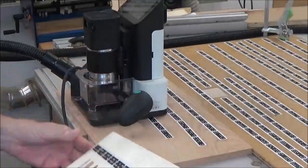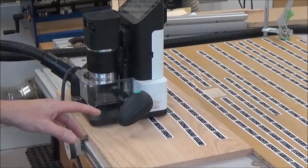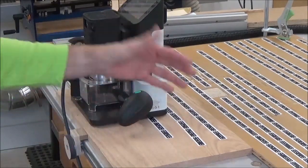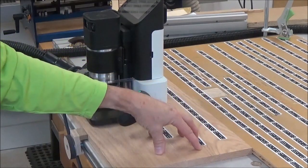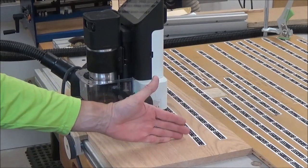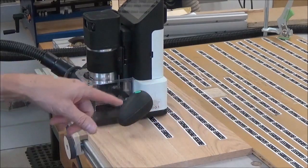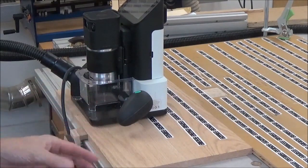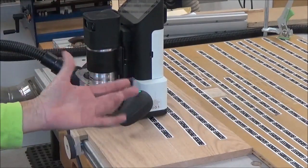I'm going to try this and see what happens. I won't bore you with the setup and the cutting, but what I'm going to do is round out the negative space and go 25 thousandths outside the line. Then I'll show you when I cut the letters — I should be able to cut those at actual size, and they should drop in and be pulled out without any trouble.